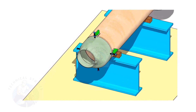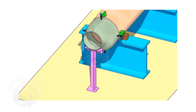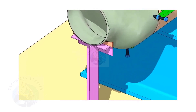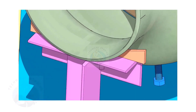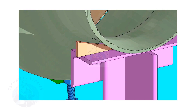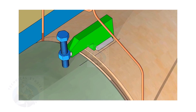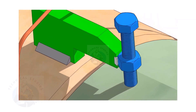Put the reducer in the clamps and slightly tighten the bolts. Arrange proper supports below the reducer — the height of the support shall be adjustable. Here, I used simple wedges. Put the gap rod in the joint. The gap shall be 3 millimeters to 4 millimeters depending on the welding process.